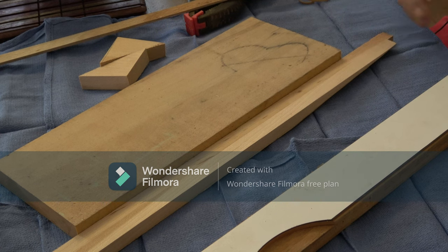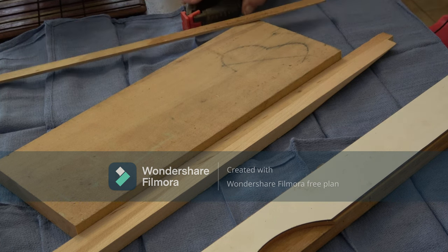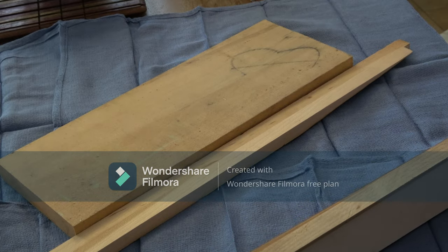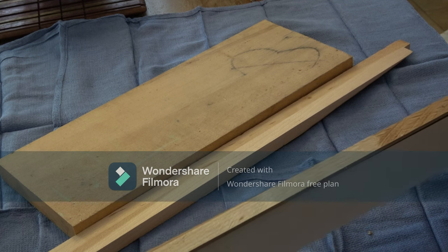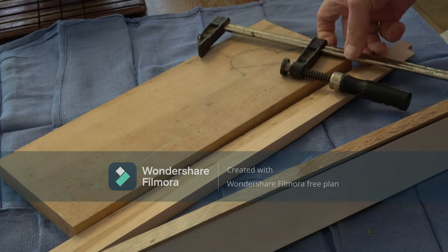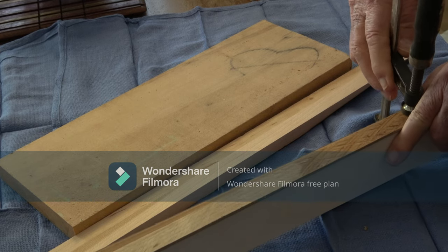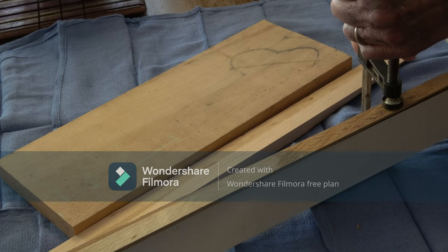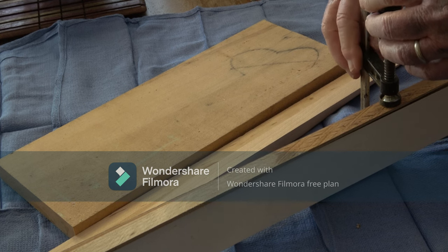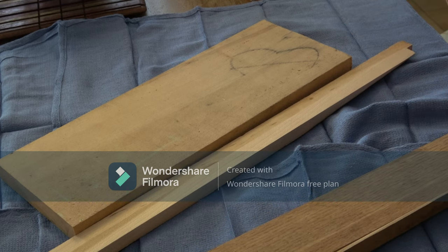So you've got the homemade versions and the spring clamps. But with this style of F-clamp, if you look at it, attaching it to the board really takes two hands. If you start screwing it down, all this is going to do is move up because it doesn't have a positive catch on this side. These are relatively inexpensive, but if you've got two hands free, they work very well.